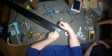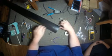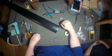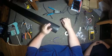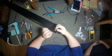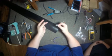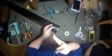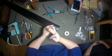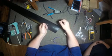Now when it comes to putting your binding post into this stand, this is something I heard a long time ago from a commercial architectural engineer. He had said that in hospitals, if the hospital is done to code, every 3-prong 110 outlet should be upside down. That's so if something ever comes down and hits the extension cord on the wall of the outlet, they'll always hit the common ground rather than hitting one of the hot legs. So I've been doing that on everything I ever do.